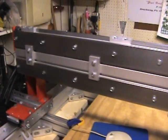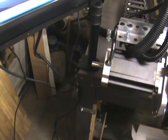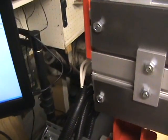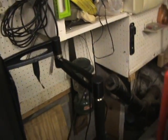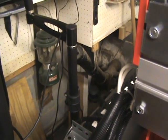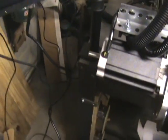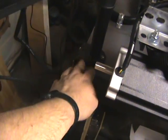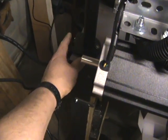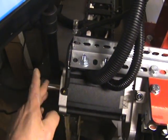Now, as to the things I've done to update here — I went out and purchased, actually got it off Amazon, a desk mount monitor stand. Got it for about $31 with free shipping. I've got two swing arms, so I've got plenty of room — probably about eight inches of adjustment up and down. I just took the clamp mount off the side of it because the base piece had a piece for the clamp, and it was just bolted together. I put some spacers in and bolted the thing down to the table, and it just clears the X-axis shaft.